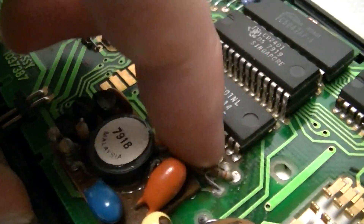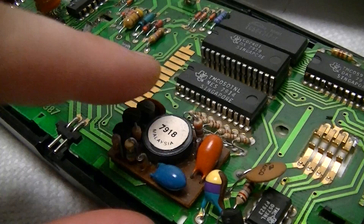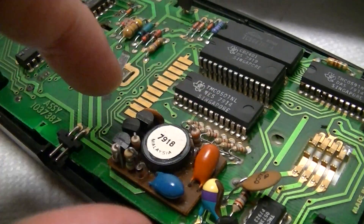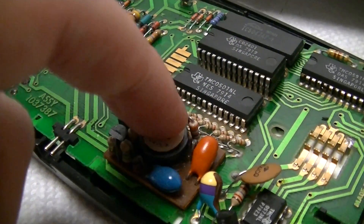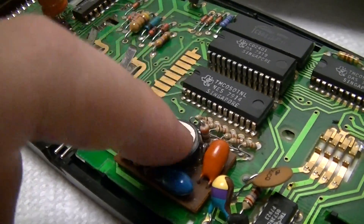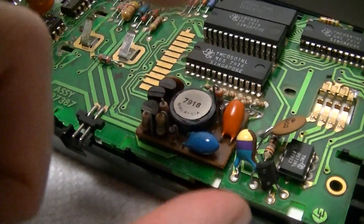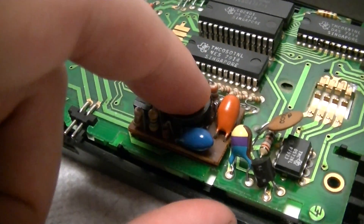I'm guessing bus bias resistors. In the later versions of the TI-58C, they're just conventional quarter-watt ones instead of these one-eighth-watt ones. And they're taking up the space that this power supply thing would, because this is the location of this power supply thing in the TI-58.